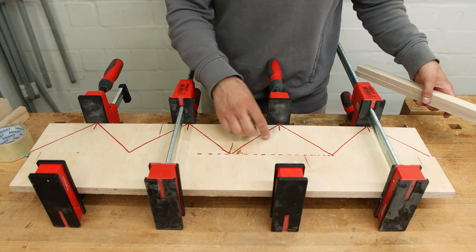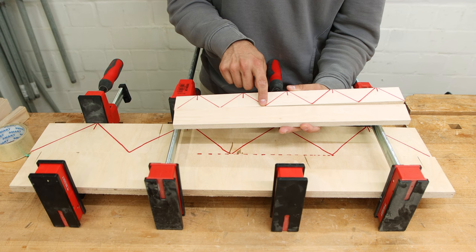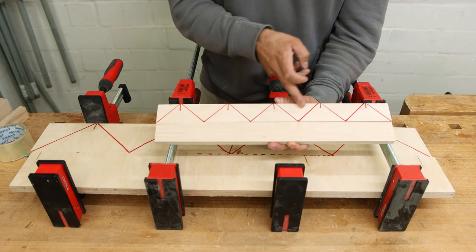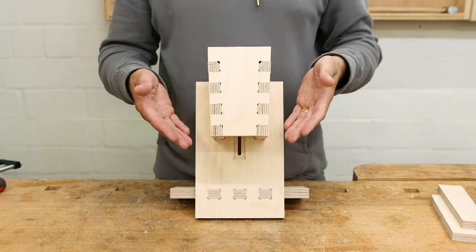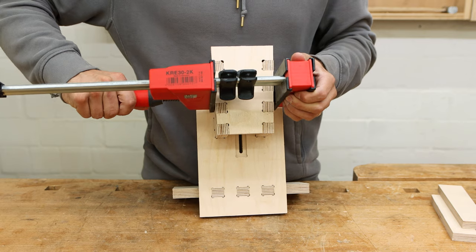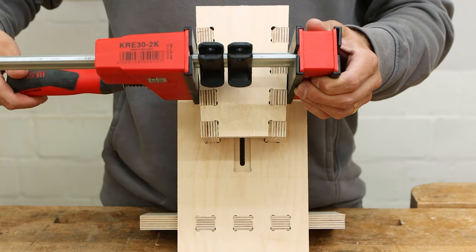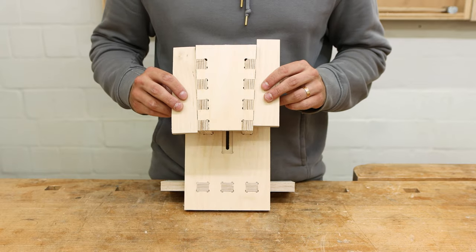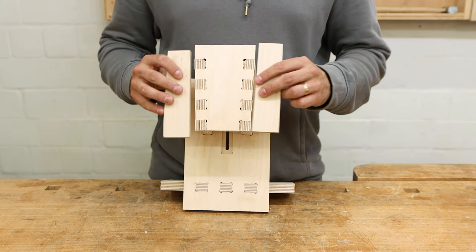As you can see, I would need four clamps to have even pressure along the whole glue line. The paradox is that when you have a narrower workpiece, you actually need more clamps, because the pressure cannot spread as far. On this workpiece that is considerably narrower, I would need five clamps instead of four. Applying pressure on tapered pieces is also tricky — when you clamp a taper, only one side of the clamp touches the surface, so you won't get even pressure. An old trick is to cut off-cuts with the same taper and place them on the workpiece to create two parallel clamping surfaces.